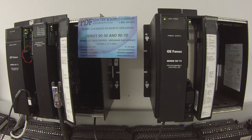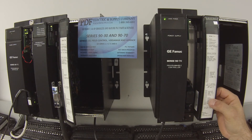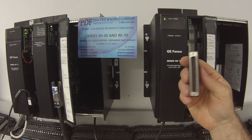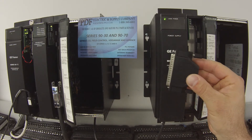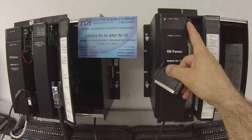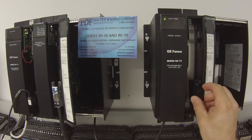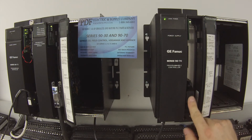Another crucial part: since this is the end of the rack — the last part of the system — I need to have a terminator resistor installed on the expansion port. It looks like this. The part number is IC697ACC702 bus terminator plug. You've got to make sure that you have one of these installed in order for this to work. When you install this terminator, the middle LED — the second LED down — will say termination installed. That's a key indicator that the module is already powered up, it sees the terminator is installed, and it knows it's at the end of the system.